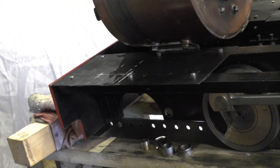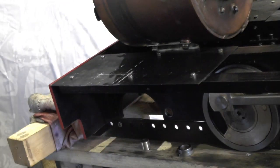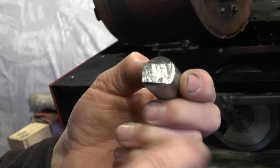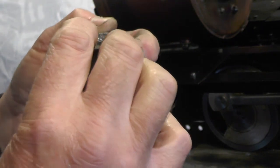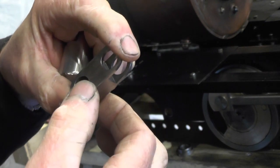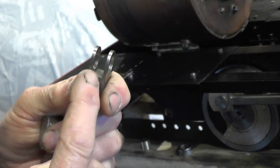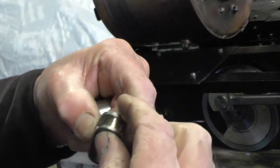and also off camera I've just been making this brake arm, and this is just a straightforward piece of rectangular stainless steel which I've cut from a piece of round stainless bar to give me that section, which is half inch thick, 3/4 wide, and it's 1 3/4 long. It's just got two holes drilled in at 1 inch centres, and in one of the holes there's a slot been milled. I've milled that slot, and that's where the nut's going to fit in the brake arm, like that.